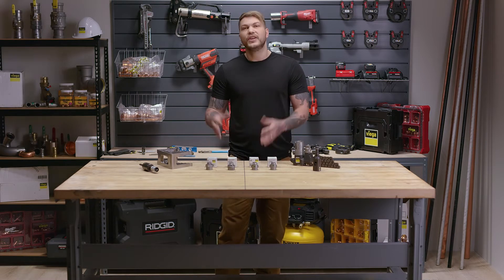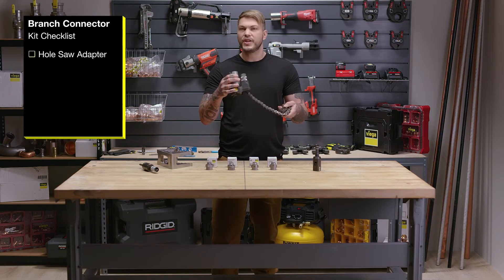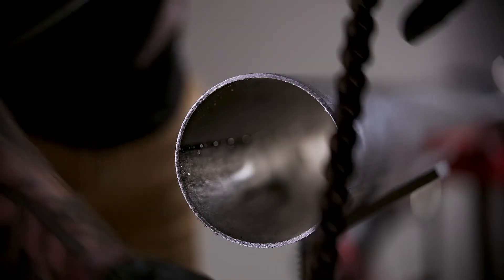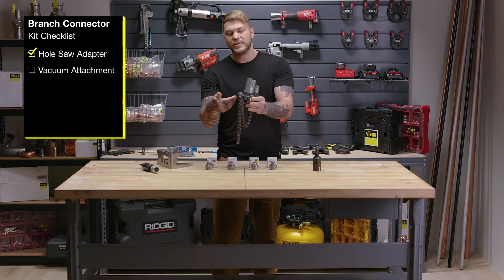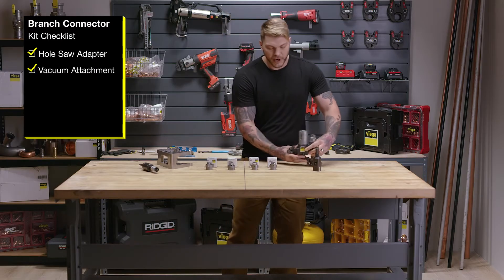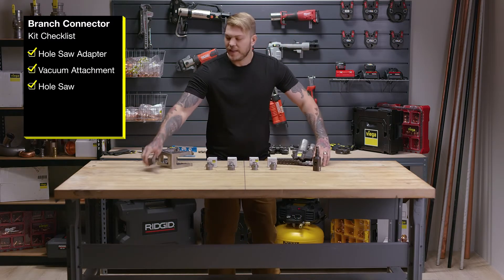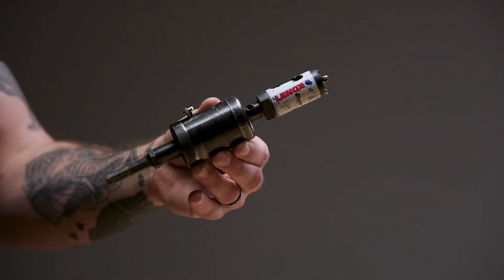To install these fittings, you're going to need the branch connector kit. It comes complete with the hole saw adapter. This chain vise assembly actually wraps around the pipe — that's how we drill our hole nice and straight. There's also a vacuum attachment to suck the shavings out while we make that connection. The next part is the hole saw itself, which has a drum on it and a little pin so you don't drill through the opposite side of the pipe.